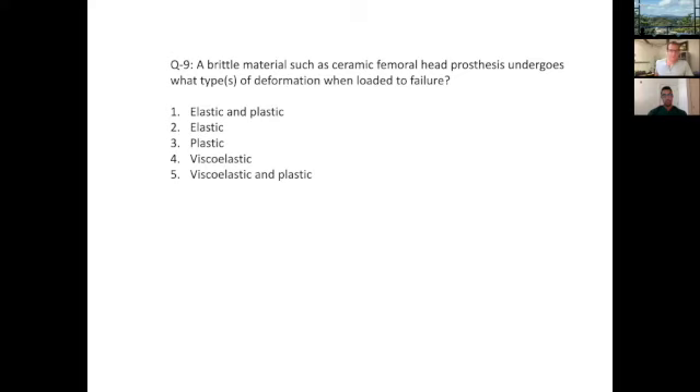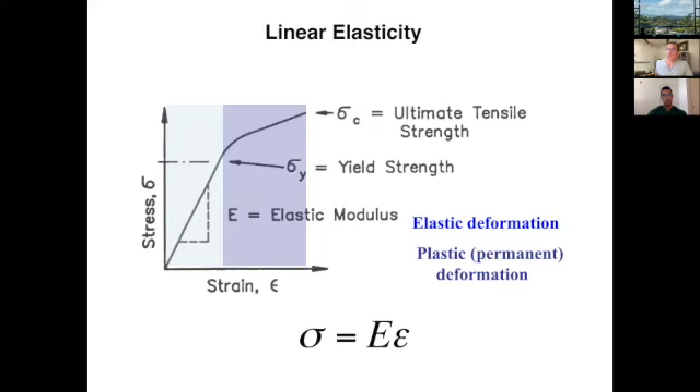When we talk about elastic versus plastic materials, elasticity is the characteristic of the original shape being maintained after you remove the load — the classic example is a rubber band. Most materials have an elastic regime where if you're within that regime, you can unload and recover the original shape. If you push the material beyond its elastic state, you're inducing plastic deformation — unrecoverable deformation. Certain types of plasticity can be partially recovered, but generally not fully.